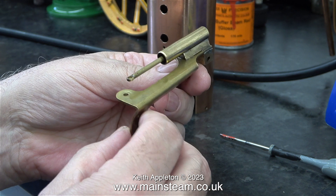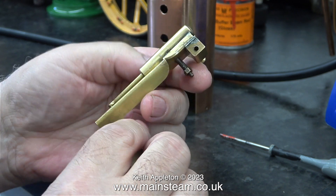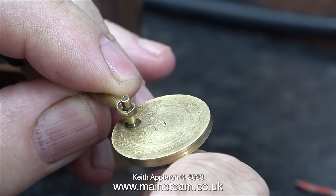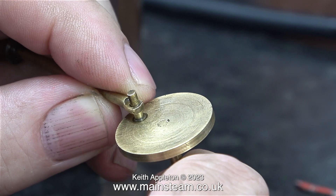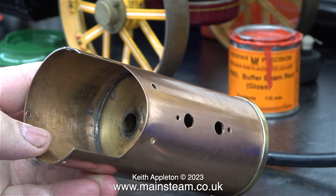The main mechanical part, which is the oscillating cylinder and the frame that mounts it to the boiler, really is quite good. Even the crank web with its brass crank pin seems to work — it's been there since the 1940s. I can rework this crank web to fit a stainless steel crankshaft, which will run in phosphor bronze bearings on the main frame. There is some play on the crank pin, but this is just a simple steam toy and I want it to be safe.